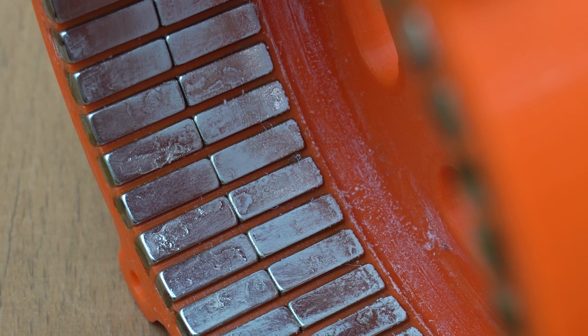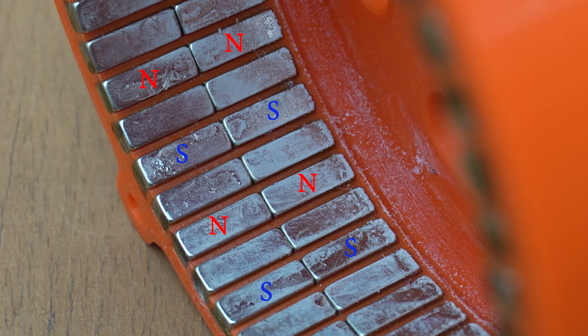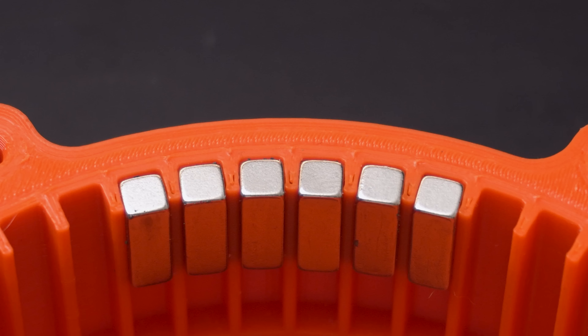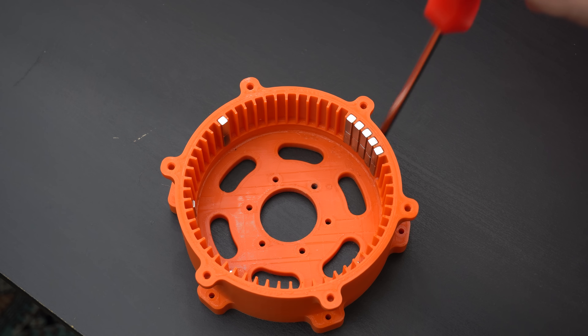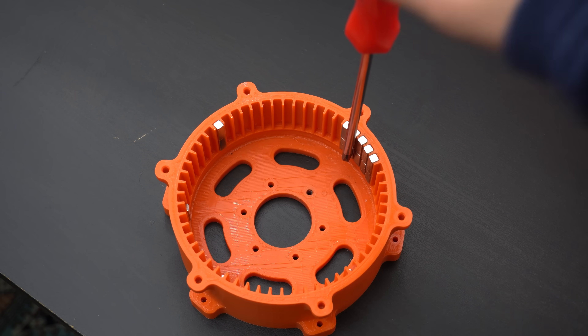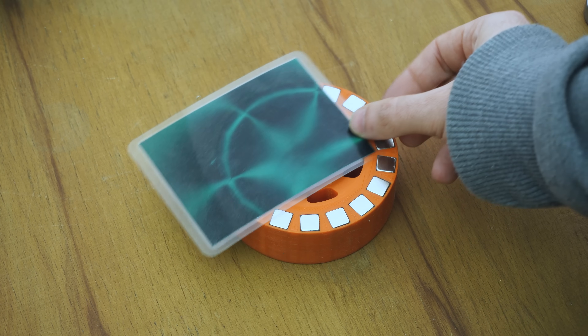As the ring gear rotates, it spins faster and in the opposite direction. The magnetic gear is completed by the addition of a sun gear that can engage directly with the modulated field, and in such a concept magnetic forces play a key role in the slip torque. I went from the alternating to the Halbach array to increase the magnetic field in the ring gear, which allowed us to benefit from the leaking magnetic fields by eliminating the need for back iron. I basically offset the north poles of the magnets by 90 degrees, resulting in almost all of the magnetic field being directed inward — this side shows almost no magnetic properties at all while the other side does.